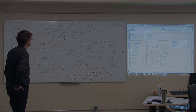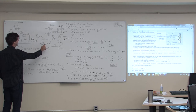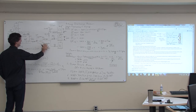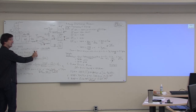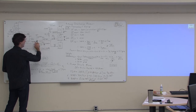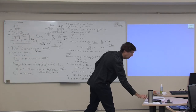One correction: when calculating the downstream flow rate, the 8.47 US GPM already includes the minimum flow bypass, so we should have used 6 × 1.2 = 7.2 GPM coming from the tower, plus 1.44 from the hydro cracker, giving 8.6 US GPM — not 9.91. The pump flow rate is still correct at 8.47 since the minimum flow bypass should be included. This means frictional losses are off by about 10–12%.